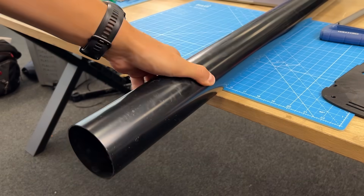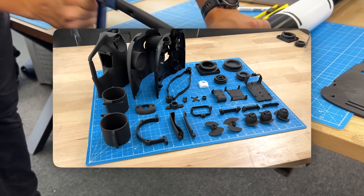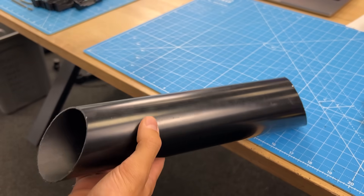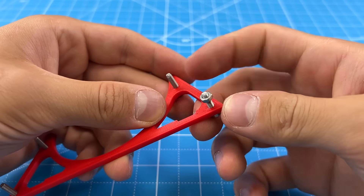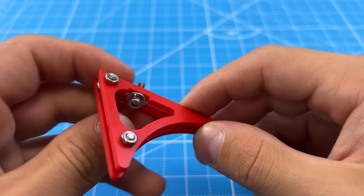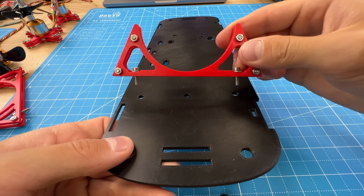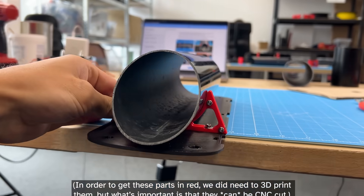Let's start with this pipe. Our first challenge is that we can't use custom 3D printed parts like in every other project on our channel. That's because we want to make this design possible to build for everyone, even if they don't have a 3D printer — and 3D printers can be expensive. That's a major obstacle, because 3D printing makes things very convenient. We won't be able to make custom parts that perfectly fit all the other components. Instead, for the frame of the drone we'll need to use only flat parts. These can be CNC cut from thin sheets of plastic. You can also 3D print them if you want, but CNC cutting is generally a lot cheaper. Now we need to use these parts in new creative ways that somehow connect together.